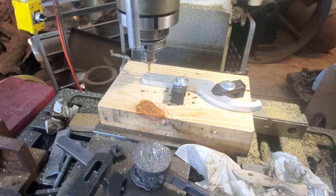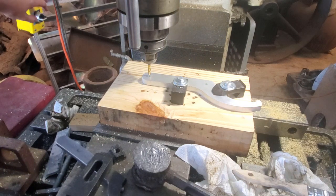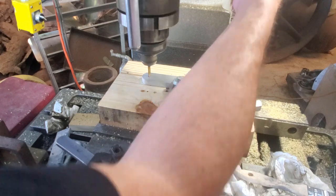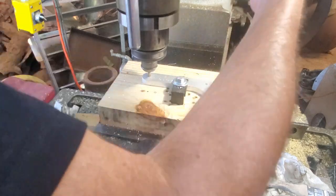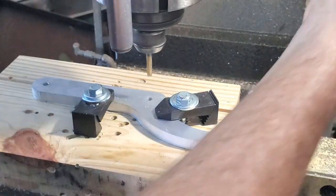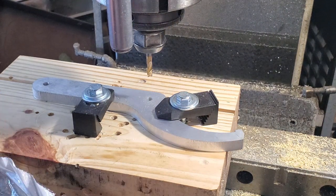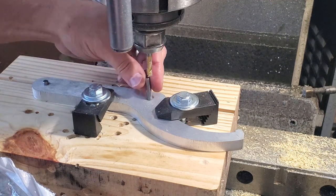I'm going to put a quarter-inch hole at this location, step over five inches, and put a second dowel at that location. I've got a pack of one-inch by quarter-inch McMaster dowels and those are going to hold the location for me. Now I've got to change over to my round-over cutter.